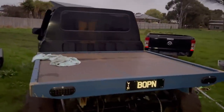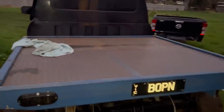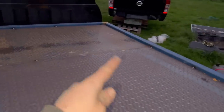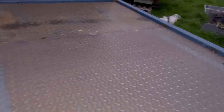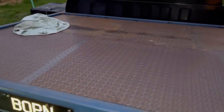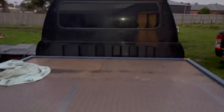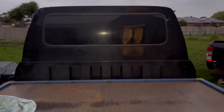I've got a bit of a deadline so I haven't been filming everything in depth, but I've got the floor cut on the guillotine and done a few little tack welds. When I pull the tray off next I'll do longer stitch welds, and the rest I'll seam seal once it's painted. Underneath I'll do tack welds as well - I just kept going around until there were no vibrations and no rattling on the loose spots. By the time it's stitched and seam sealed it won't move at all. Now I can move on to the headboard.